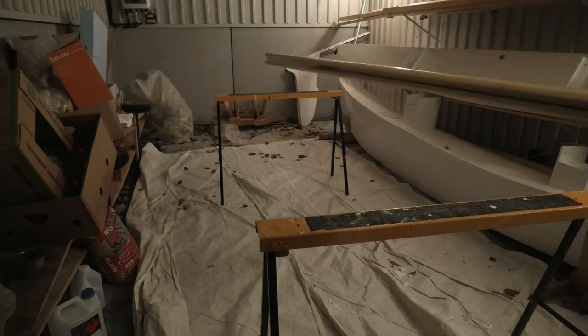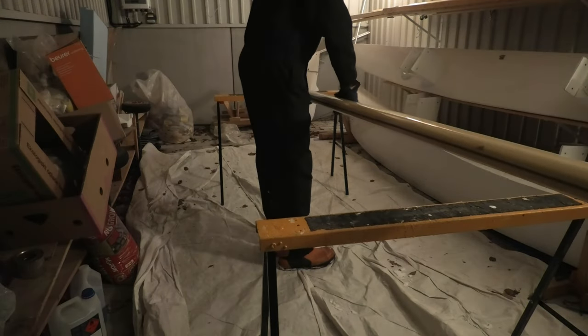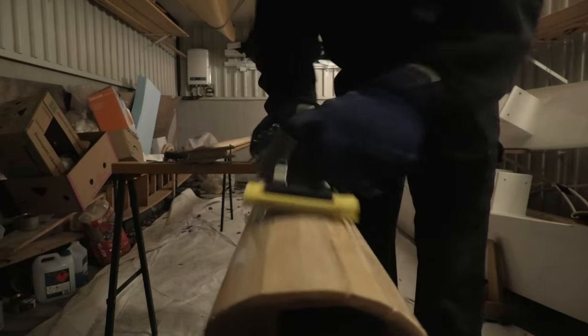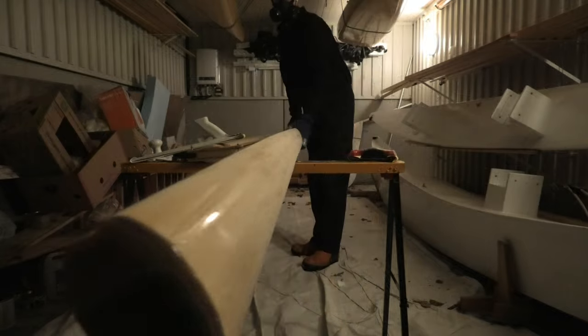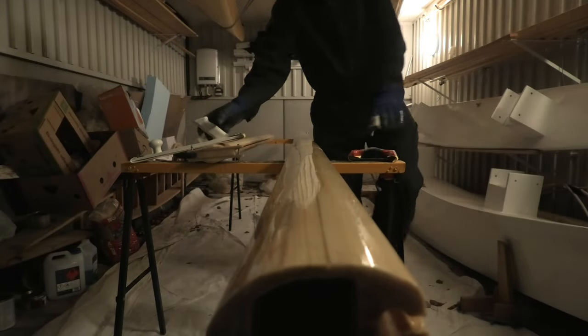After one more coat, it's time for the second sanding. Sanding with 180 grit paper gives a sticking structure for the following coat and still gets the surface as smooth as possible. Any curtains from applying too much varnish are carefully removed. I will only apply 5 coats this time, so I want the surface to be flat for the final coat.